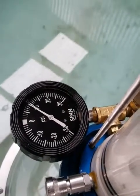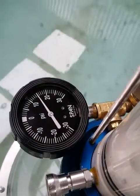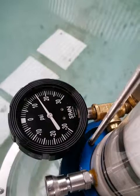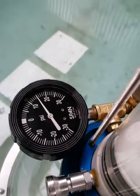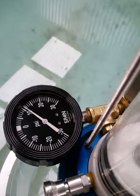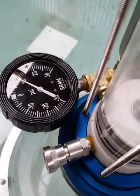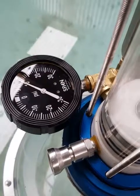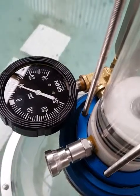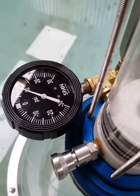It's just compressing the gas — just starting to relieve. It's got a maximum of about 17 psi, started to crack at 12, keeping a constant 15 psi in there. That shows the exhaust valve working: as the gas increases in volume on the way to the surface, it'll automatically keep it down to a safe limit.